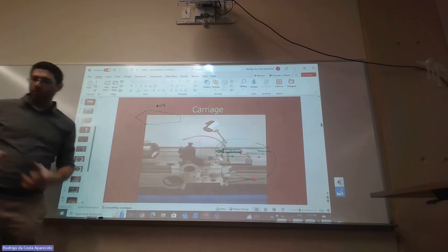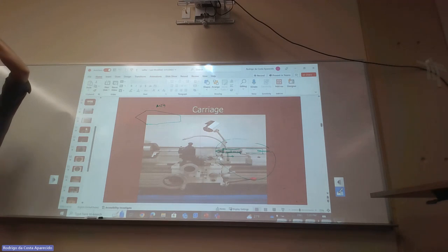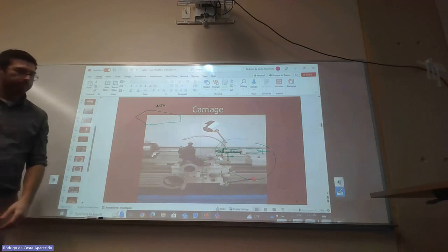But it's a similar effect with the drawbar coming from the top, right? Whoever's on the mill, notice that you can screw the drawbar all the way up and pull it out, and your chuck is still stuck in there, right? And then you come in and give it a little tap, and then it comes down, right? Just because those parts match perfectly, you actually have to push it out. Otherwise, it's not going to disconnect. Good.